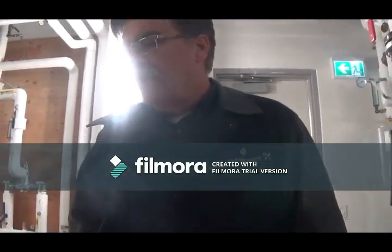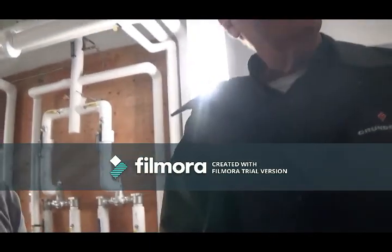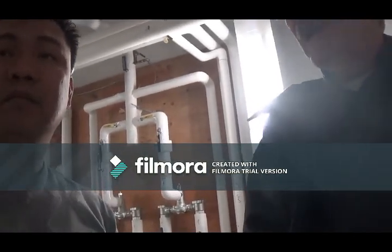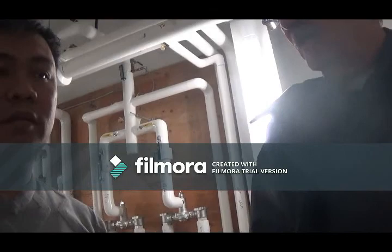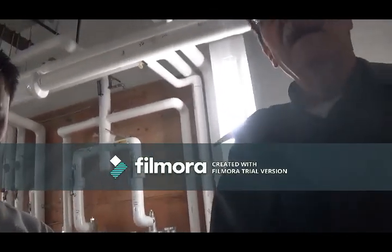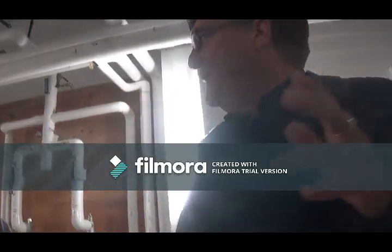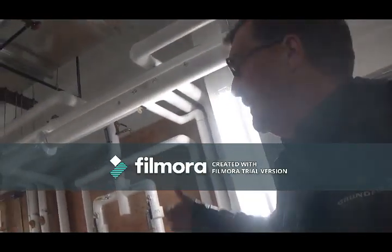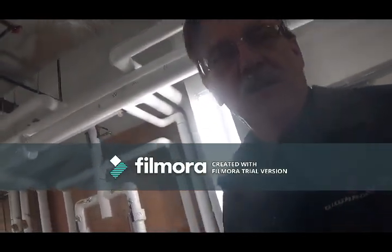What do you call this one? I know this is primary heating, the heating water pump, HWP. Yeah. So this will provide water for your unit heaters, cabinet heaters, and the domestic. Okay. The system water pump provides for the fan coils. But that goes for every pump in the place. The small circulators are non-serviceable. There's no leakage, there's no mechanical seals, no lubrication to be done.